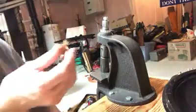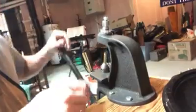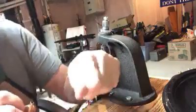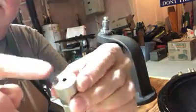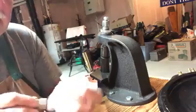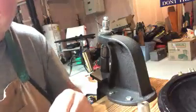Once I do that, it's just a matter of taking that cartridge, putting it in, and running it up. You can feel it resize, and you'll kind of feel the primer pop out because it's decapping at the same time. So now that has been full length resized. I recommend having a case checker — so now we can check this, and see there how it goes in perfectly flush. So we know that's going to chamber in my firearm, and this will be good for any gun — semi-auto, bolt action, doesn't matter.